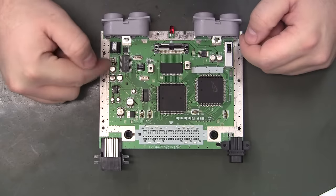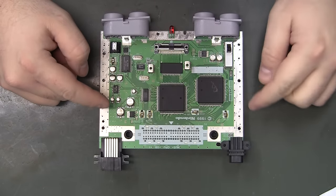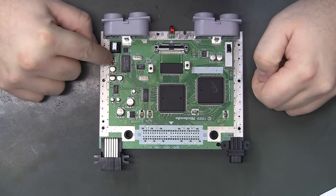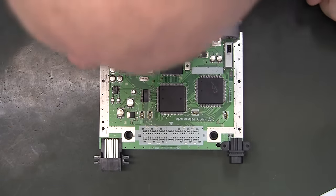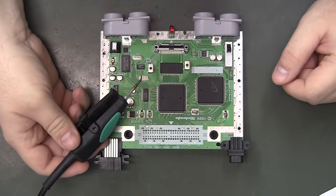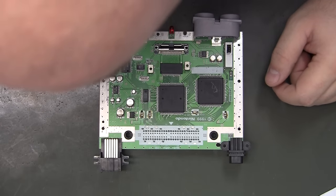I did add some solder back in afterwards, and I will say you will probably need a pretty good iron for this because they're power rails, so they've got really big, thick traces going to the pads, and apparently not much thermal relief. Had a lot of trouble with that one, but it was hard to get to as well. If you've got hot tweezers, like so, I've got one burnout tip on mine, that is also helpful if you have those. Very expensive, but they do work.